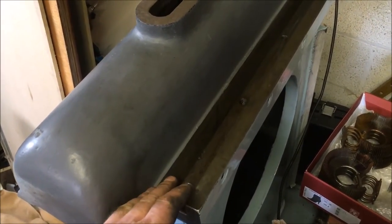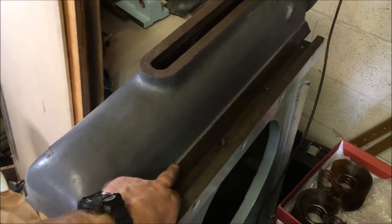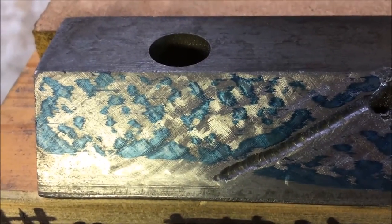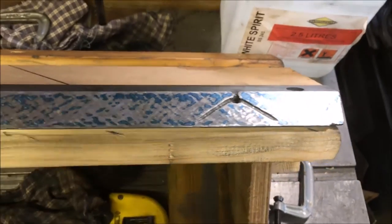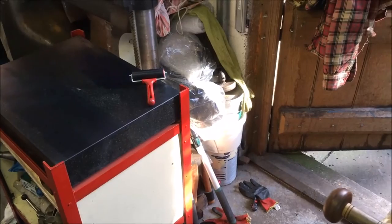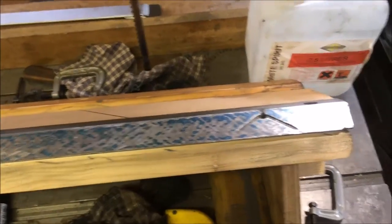I'm not sure why that area is worn - there's not going to be much lift given that you've got about 20 inches of bearing surface and that section's in contact. Maybe it was never in contact in the first place. I'll probably call it done on that until we get the mating face sorted on the ram. Besides which, there's a sunbeam glancing onto the stand of the surface plate, which has clearly warmed it up and distorted it, so it's no longer a valid reference surface.